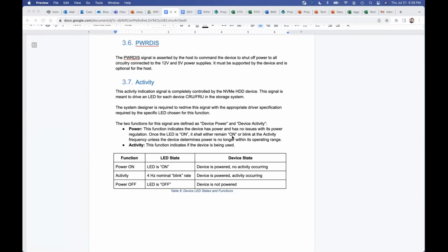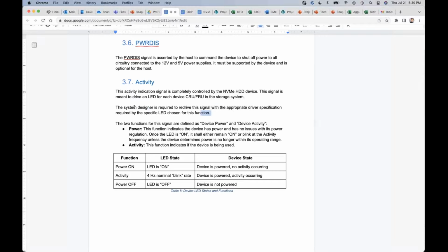Instead, we continue to reference the SAS and SATA connector spec for polarity and sink capabilities. And I think what we should do here is make a statement that we'll assume the lowest of the two in terms of sink capabilities and stick to the SATA sink, and say that the system designer should assume this lowest level of sink capability and provide additional driver capabilities. So that was my first attempt at it. If you can help me rephrase it and put a circuit there, I can probably try to do that.